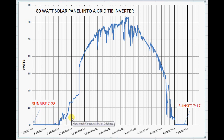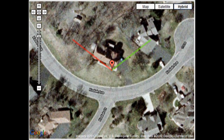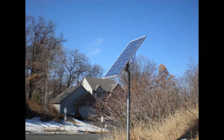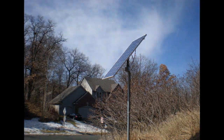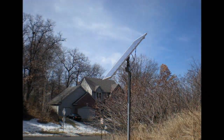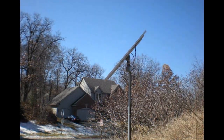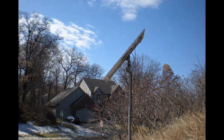Using this you can calculate how long it's going to take, given any day of the year, before any kind of power is going to be generated from a set of fixed panels. Here's what it will look like on June 21st, the longest day of the year — you can see the sun comes way north of east and will take a long time to swing around to get into position to shine light on a set of fixed panels. What that suggests is that tracking does make good sense. If you look at a lot of the commercial solar installations and power plants put up, everything is on trackers. The longer the solar day gets, the more sense it makes to have your solar panels pointing towards the sun rather than waiting for the sun to come around to where the panels are facing.